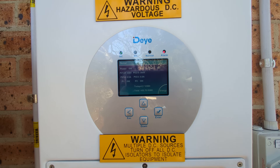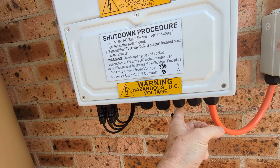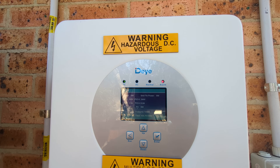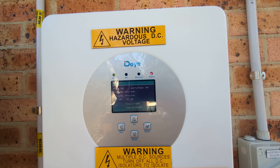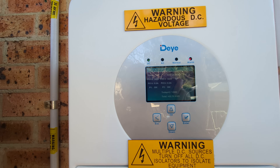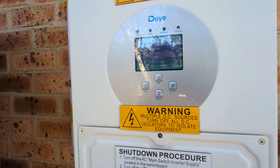And if I actually had a load hooked up to the generator output, I could keep powering things while the sun's up. And if you don't have a battery, that's okay — your generator output will just go off when the sun goes down. But at least during the day you will still have power. So even without a battery, a hybrid inverter is useful.